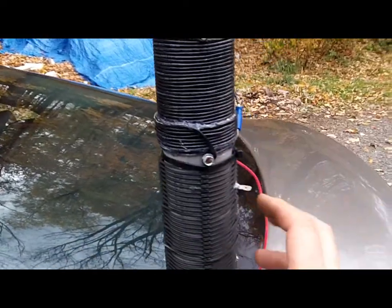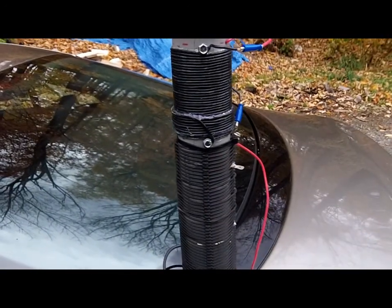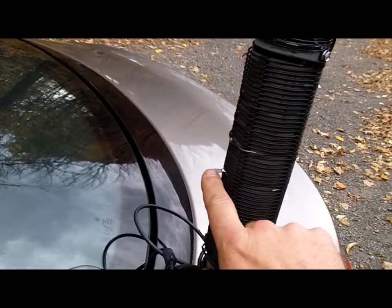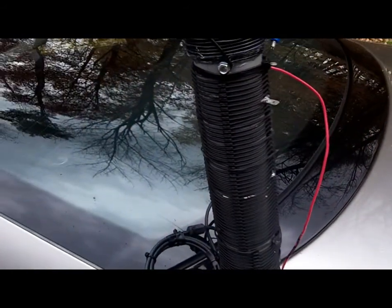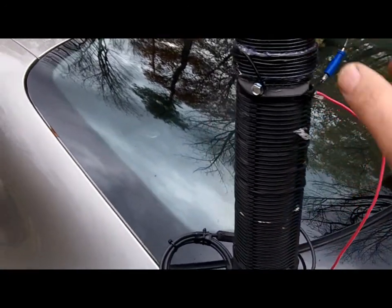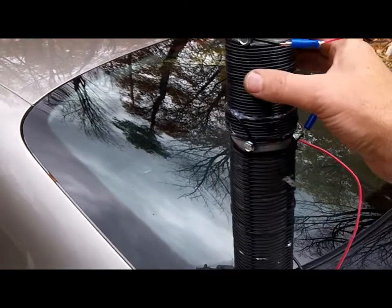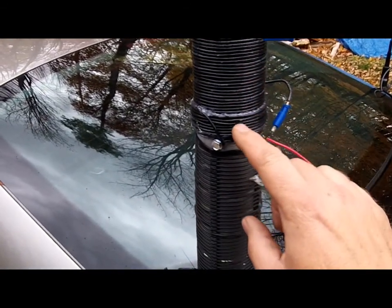The exact specs for this coil: I used the inducting coil for my 40 through 10 meter bands, and I have my different tap points. The only thing I had to move was the 40 meter tap points. Down here it gives me a 1.1 to 1 SWR. I took the coil off the tube — it's a 2 inch PVC core.